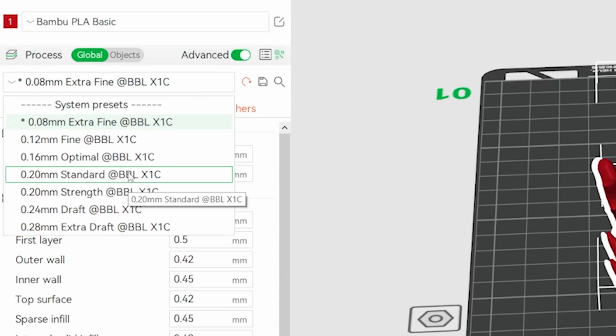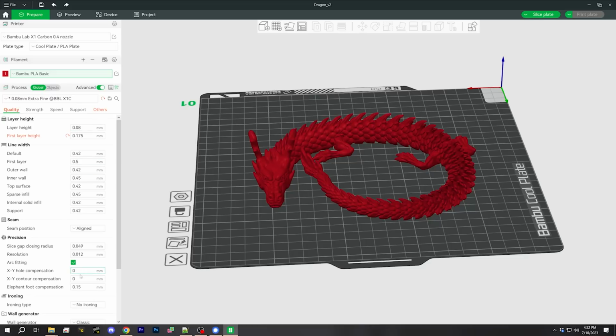These presets are what you want to pick if you're looking for that promise of print and go, zero hassle, everything as close as possible to the just-working out-of-the-box experience that Bambu promises. If you use these presets with Bambu branded filament, you are very, very likely to get a seamless result. But obviously, you can use your own filaments. And if you do that, the presets often will work okay, but you might end up in a situation where you need to tweak a few things, especially because the Bambu printer prints so much faster by default than most filaments are really prepared for.